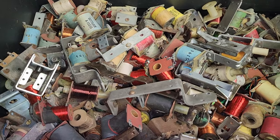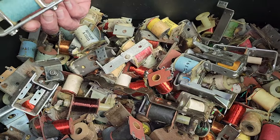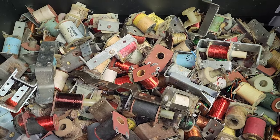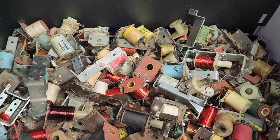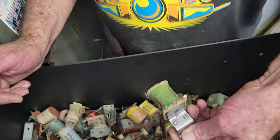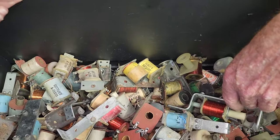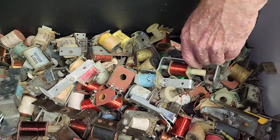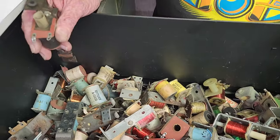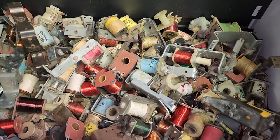Here's another assortment of Gottlieb coils — we've got knockers, not just the frames. Generally the only Gottlieb coils we have to buy are the 9736s — they've got the small bobbin. We've got the small bobbins in there. We have some series relays and occasionally 9740s. In that pile of coils we had in the tubs in the other room we've got quite a few 9740s.